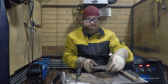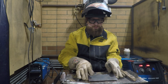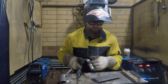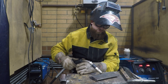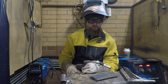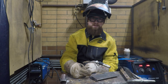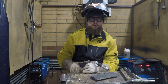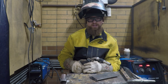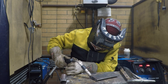Okay, let's get our helmet on. Now we've got the plate tacked. I tend to have the plate slightly at an angle in front of me as I drag along. All we're going to try to do is get a weld puddle in there — we don't really need to do any manipulation. What I'm looking for in this weld is a consistent weld size and placement. Set the quarter-inch settings on the flux core chart for this weld as a good starting point. Do a dry run first — make sure you feel comfortable.